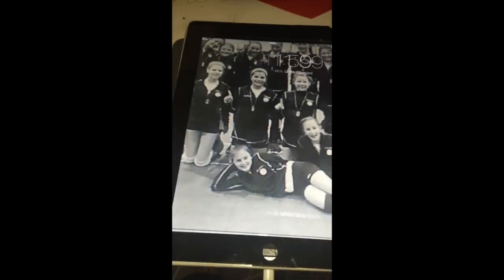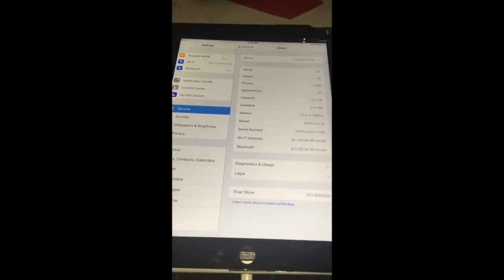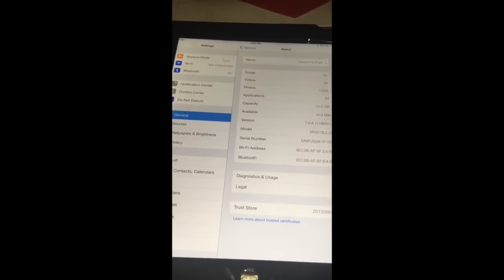Okay, it's been a while, and this has just been sitting on the charger. And it has started up. It's detected the charger and charged all the way up to 46% charged. So this is a success, and iPad 4 no charging because of U2 charging logic IC damage is solved by just changing that chip.